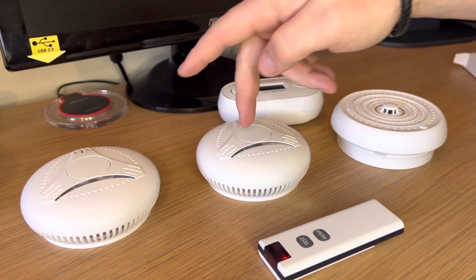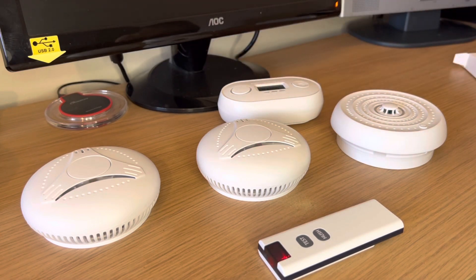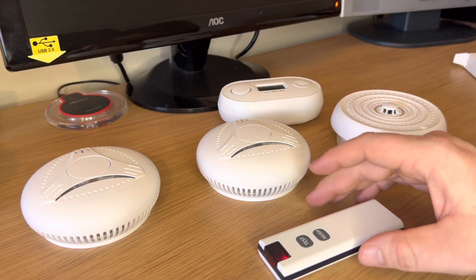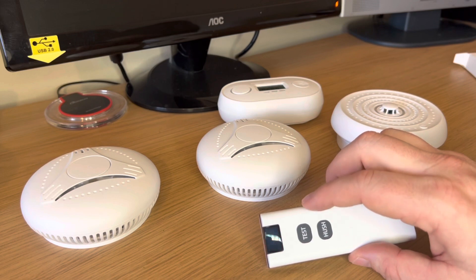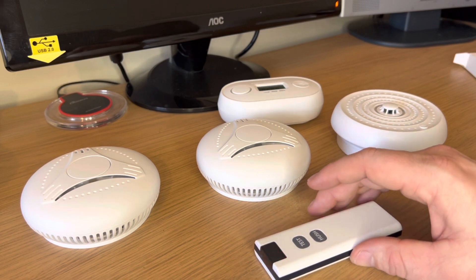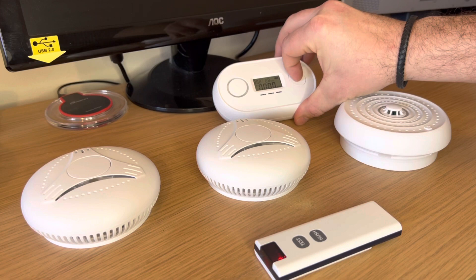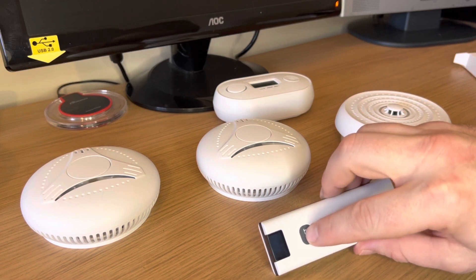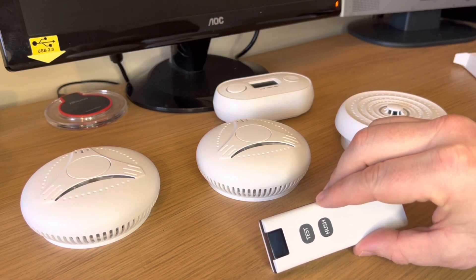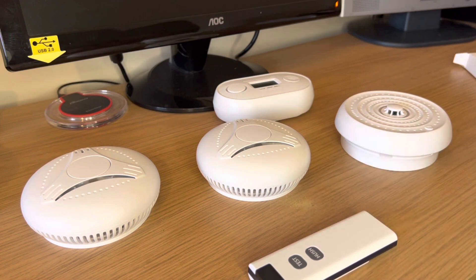This device is now added. The light continues to flash rapidly. If it goes out, simply press and hold the remote for three flashes and then add the other devices. You don't have to add the carbon monoxide detector but you can if you wish. Go back to your master device and press the test button once to close the circuit. Give it five or ten seconds for things to synchronize, and then press the test button once to test all the devices.